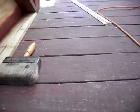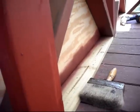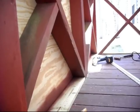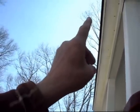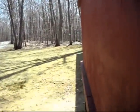and these floorboards, the 2x6s, are pressure treated. But I just want to try to protect the plywood a little bit. And being that this is being converted over to a porch rather than a deck, we had to cut back on this so we don't have any splashage from the drip edge. The drip edge comes out 5¼. Actually, they put the roofing on a little further out from the drip edge. So the water runs down, and it definitely clears this. But when you get a driving rain or a wind or something, you're going to get water going here.